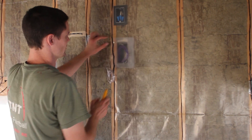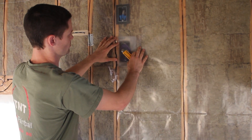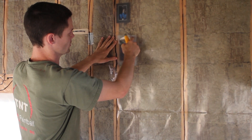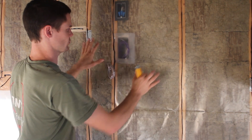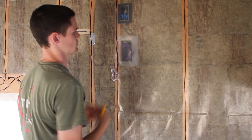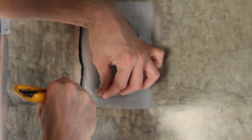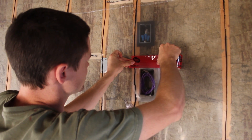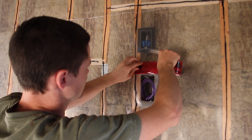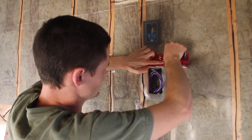For the vapor boots, they've got this sort of flange, so I'm going to cut the poly about halfway along the width of the flange all the way around. Then I can tape over to make sure the tape touches both the outer layer and the inner layer to make the seal of that seam.